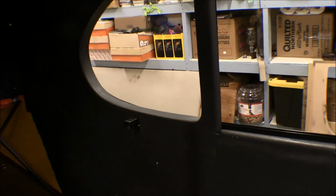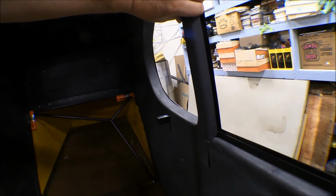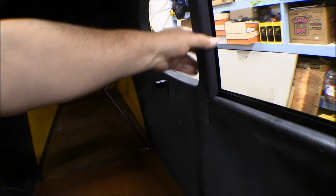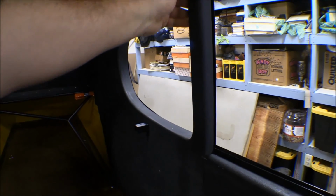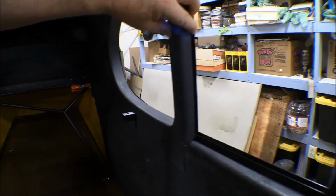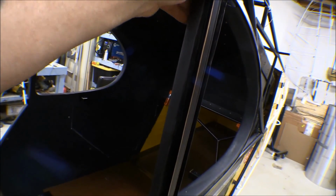Well, that window looks better now. That flange has been bent over, and we got it right tight in that window channel. So now if that window channel fits in there, we'll be fine. But that's it. Got a nice smooth radius here on the outside of it, on the cabin side of it, and then a sharp bend going into that channel. Anyway, it looks a lot better than it did with the big old flange hanging out there. So that's going to be pretty good.